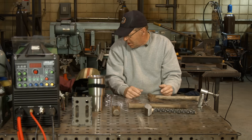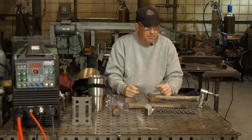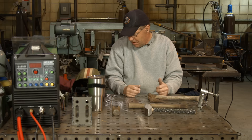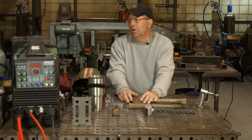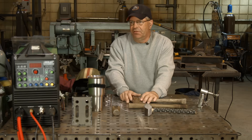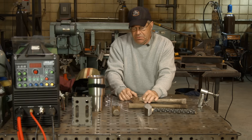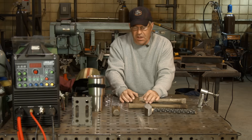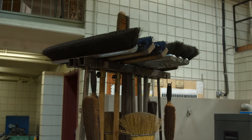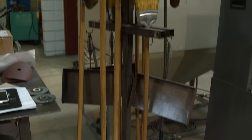The whole video is about saving tools, repairing tools, fabricating tools. We started out with the dustpan — those things are pretty tough. They don't bend up when we blow everything out and start sweeping. We've made probably a half dozen of them here in the shop and about a half dozen for the machine shop and the automotive shop as well. Projects, sheet metal, square tubing — TIG works great. A lot of times you can just tack it up and it's structurally fine. Our whole broom hanger — it's a piece of plate, square tubing, got hooks all over it. We didn't weld anything out solid; you can tack it together with TIG and it's fine.